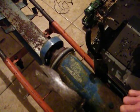Working both at the same time, it really gets it going. I filled it full of oil - it was actually frozen up, the levers were. Cleaned them up and broke them free and cranked on it for a while and nothing happened. So I pulled the valve off right here, pulled the center plug out, and filled it full of oil. I had to make a thing for it - check that out, that's some engineering. That's my blow tip for my air nozzle - hey, it worked though. I think it sucked it right up. That plug was a pain to get back in there, coming out it just spit all over me.